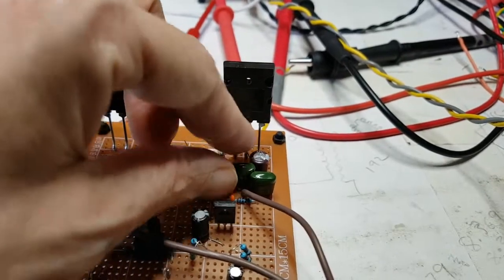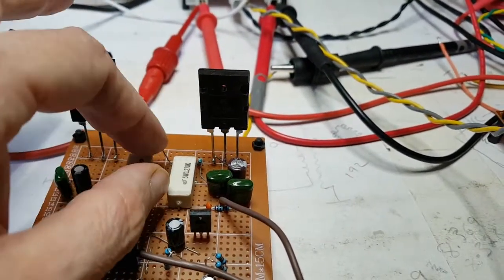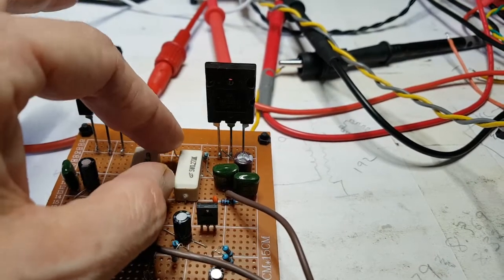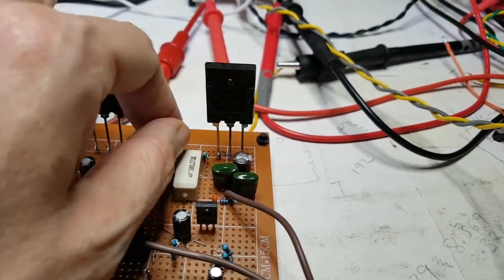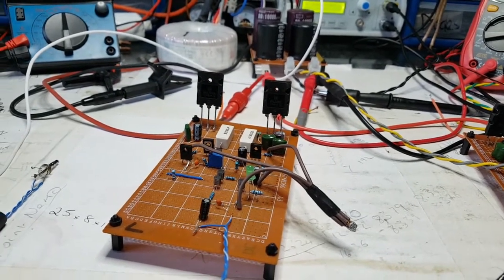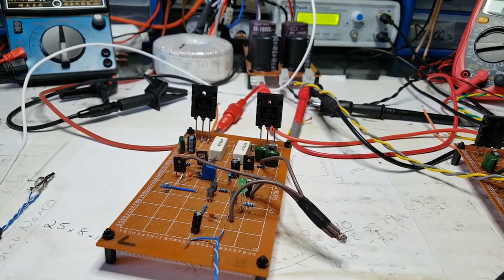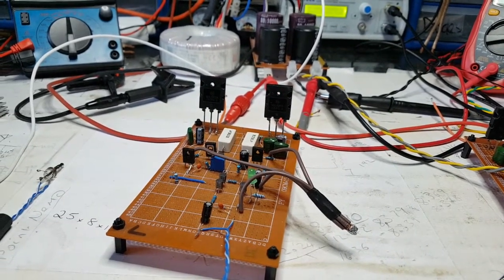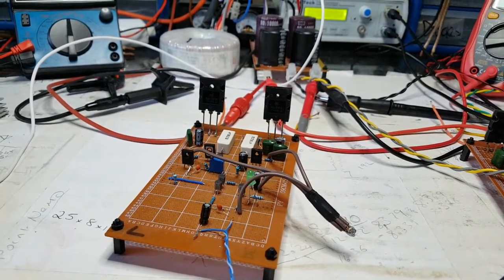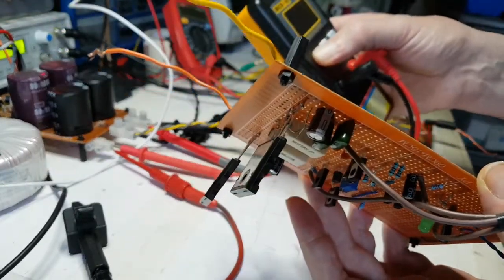I've taken off the wires, just to make sure, because this is the ground output, and this is the positive signal output from between these two. So now I'm going to check the capacitors, because they would soak up current if there's a problem there, and just start working backwards. See if this is any sort of benefit to me now.